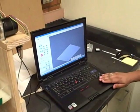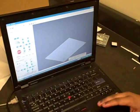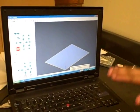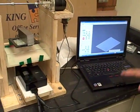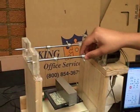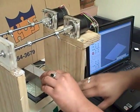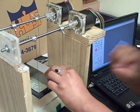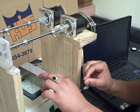We have an interface built in C++ to control this whole system. We take a part and divide it into different sections and project them on a timely basis to this projector. This program also controls the stepper motors, which are connected to a platform. This platform is at the base of the container holding the resin and its height is maintained very accurately — it can be controlled to an accuracy of 0.002125 inches.